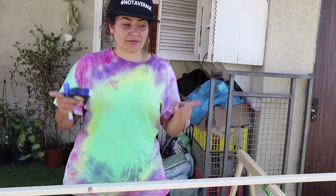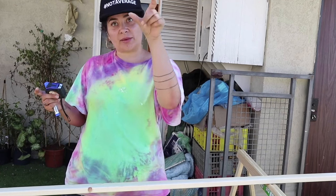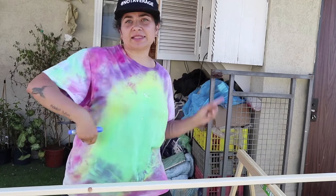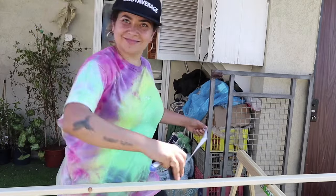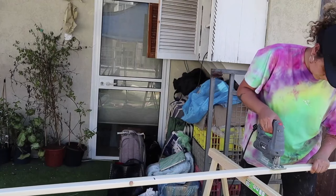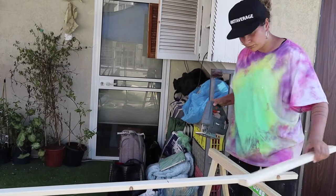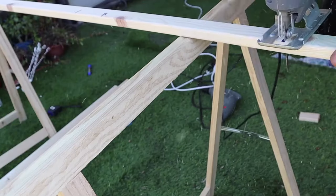You have to make the size that is 60 centimeters perfectly to place your butt inside, and that's gonna be the depth of your chair. But we already did the sides of the chair, which is 4 centimeters per side, so it's not gonna be 60, it's gonna be 60 minus 4 minus 4, it's 52. So you're gonna have to cut tons of wood of 52 centimeters to go and fill up your entire chair.